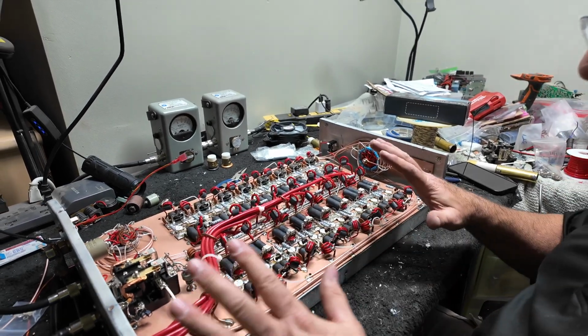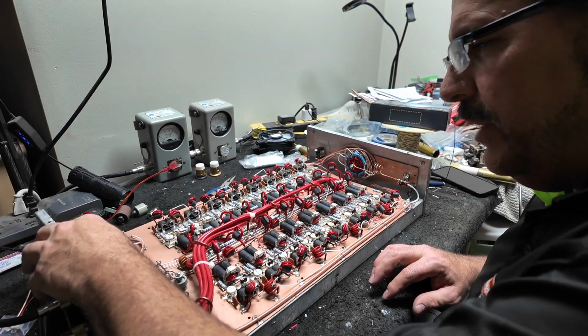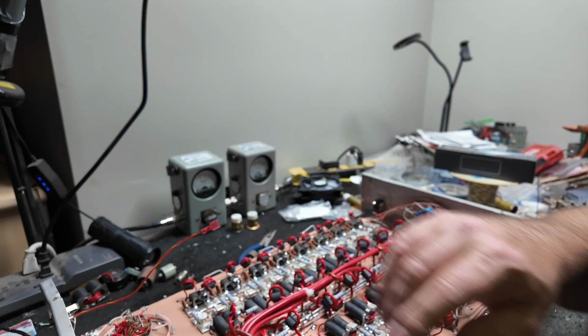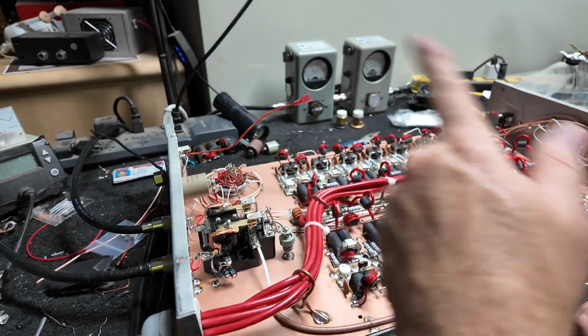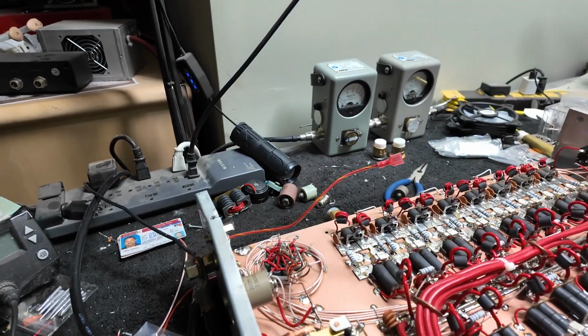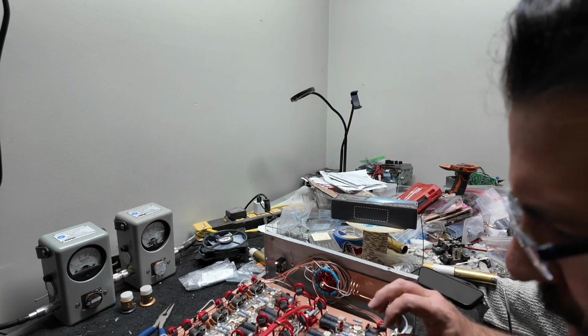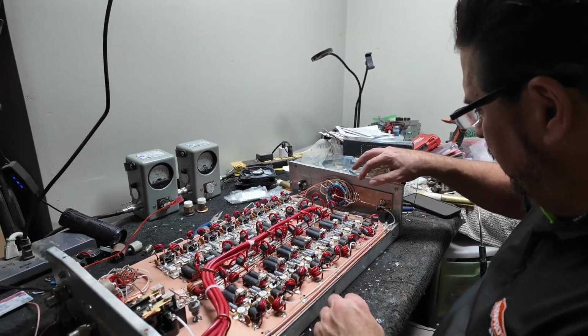Now you can just tell it's gliding. So we retuned it. We got a 200 pF doorknob in there, baby. That's what you want to have here. I want to double check the tightness of this doorknob. This custom made coil, I make these. Good luck trying to copy that. Checked all the flybacks. Everything's good, everything's soldered good. The thing's working beautiful. Changed a couple of resistors.